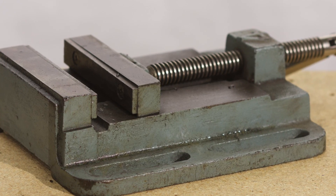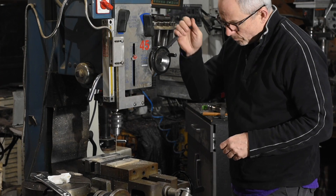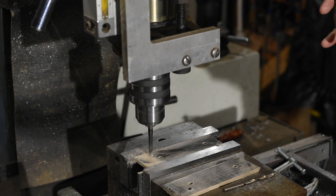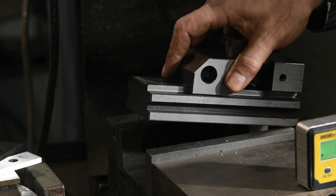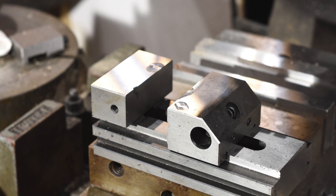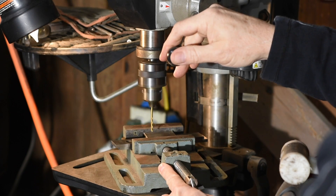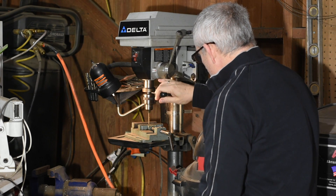Use a drilling vise. After a drill press, the thing that will most improve your drilling — certainly the best bang for your buck — is getting a drilling vise. You can get super cheap ones from China, but better is better. More mass, more rigidity, and more ability to preserve flatness and squareness will result in better drilling. This Kurt here is actually a milling vise rather than a drilling vise and is the king of vises, but you can use them as drilling vices too. Same goes for toolmakers' vises, which are really nice because they're machined square on all sides and can be flipped around easily without messing up the squareness of your work. The main point is to put your work in a vise that's flat to the table, then position a big, heavy, stable vise rather than just sliding some tiny little piece of metal around on the table, having the drill walk on you, grab the work, and so on.